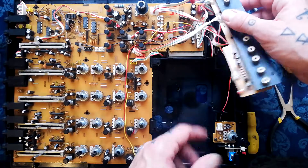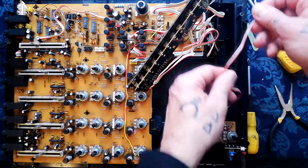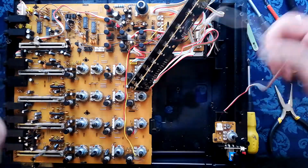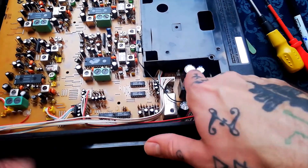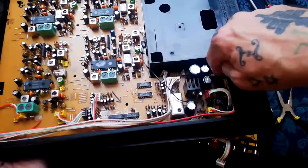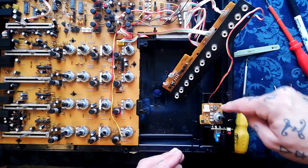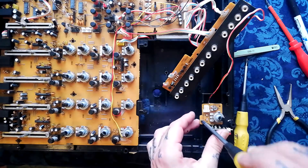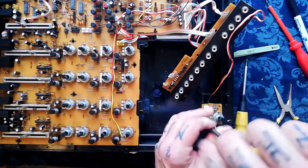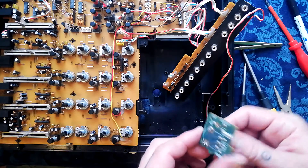The next thing is to detach these boards. This pitch control board has a red and white cable running through there. You can see I already connected it to this little header here beside the largest capacitor — it's running through this gap here. To adjust the 12 o'clock position of the pitch control you would use that trim pot there. You could probably do the cleaning without taking this off, but if you needed to do any soldering you'd obviously need to take this screw off. Medium length, wide, fairly little black screw — and that will just lift out like that.